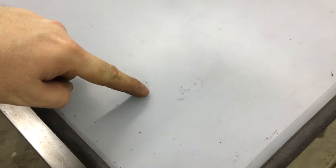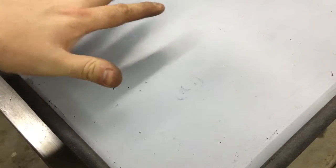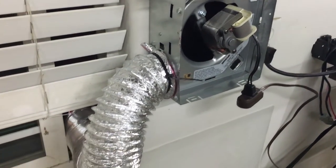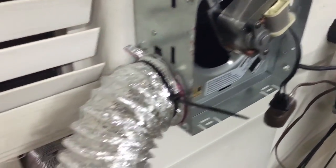That was another print that I did — so that's the base of it. I took it past the comfortable point for the polypropylene, so the layer of primer is supposed to help protect it and become a nice adhesive layer because the surface is very porous. The idea of a primer is it connects the two surfaces — the substrate you're painting and the paint itself — with the primer acting as the middleman. I'm using Rust-Oleum. Now it looks even more like a hockey rink! I also installed an exhaust fan that'll tie right into the gap in the rubber seal around the bed, so most of the steam from the bed will come out there and the fan will suck it up and push it right out the window.